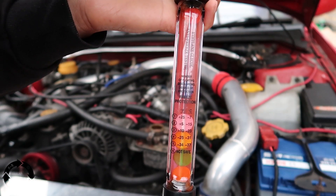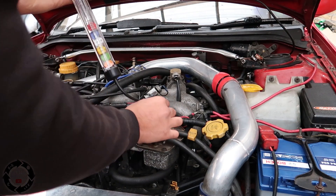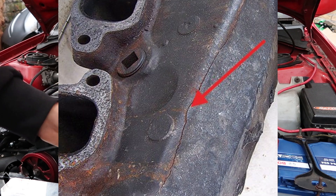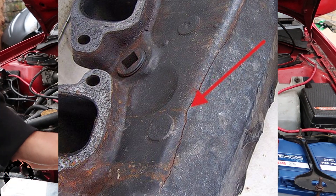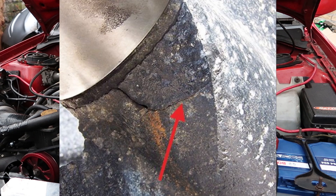This antifreeze really needs a flush — it is in dire need of a flush. I don't really want to risk driving it around, and with winter coming you don't want to crack the actual engine. In some cases the engine when it freezes over can actually crack, and for the sake of water and a bit of antifreeze it's not worth the risk.